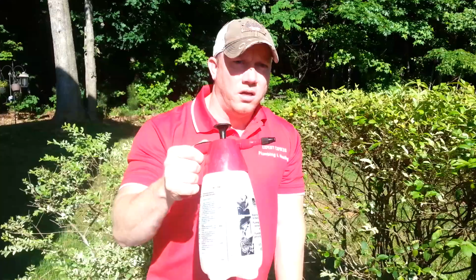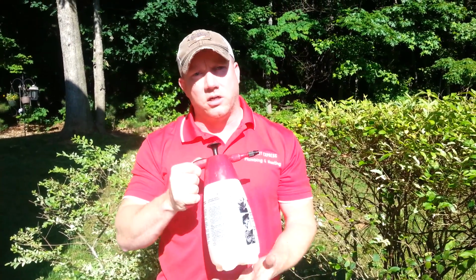Basically, the way that it's saving you money by having the cleaner coils is the refrigerant picks up heat, and that heat is dropped off out here at these coils. The cleaner that these coils are, the better the energy transfer between the refrigerant and the air passing across it. So you want these coils to be as clean as possible. So we'll show you what we do here in just a second on how we clean these, and I'll be right back.